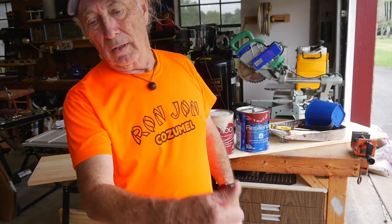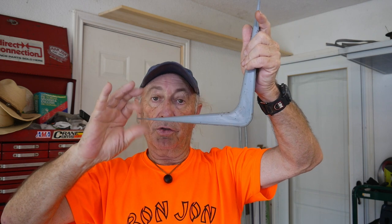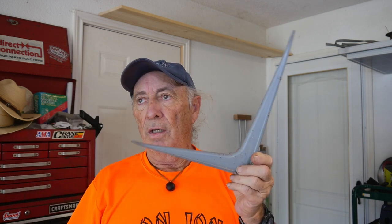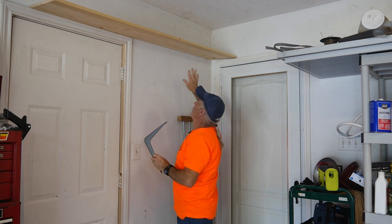We're going to need at least one shelf bracket. I'm lucky because the frame of the other door will support one end like a shelf bracket. I have one metal shelf bracket left over from a project last year. You can mount it upside down — you don't have to have it the standard way; you can flip it so the shelf attaches this way too. One option is to put the bracket here at the door frame edge, but then you've got a lot of cantilever with only the door frame for support. I've got plenty of support back in the corner.